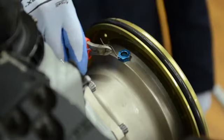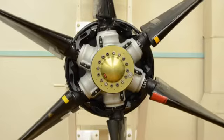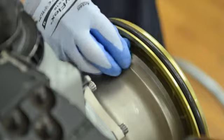Use wire cutters to remove and discard the safety wire that locks the bleed plugs to the hex head bolt. Rotate the propeller so that one of the bleed plugs is at the 12 o'clock position. Carefully open the bleed plug to release oil pressure inside the coarse pitch chamber. After residual pressure has been released, remove the bleed plug from the hole.